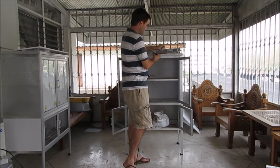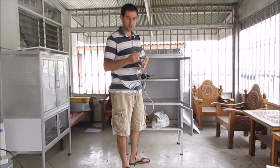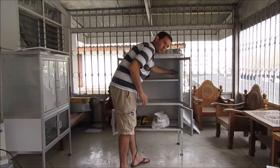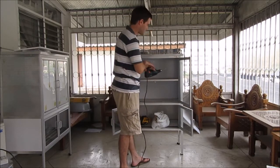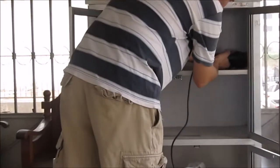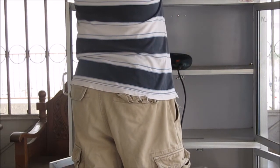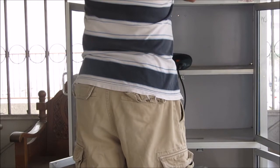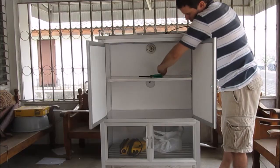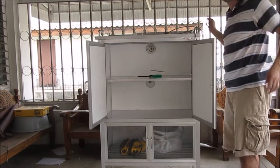One thing that you might want to do, if you're using a thermostat, we need to get our bulb inside the germ chamber from the outside. So before we glue our foam in place, we're going to punch a hole through the corner in order to slip that bulb in. So we're just going to use a large diameter drill bit and go right in through the corner. Just check our fit and make sure we can get our thermostat through. Perfect size. So we can just leave our thermostat right there in the chamber to regulate the temperature.